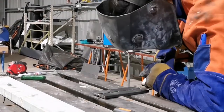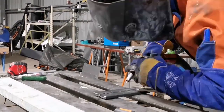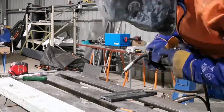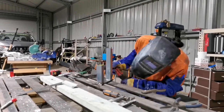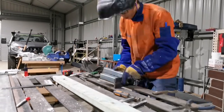To build a hinge of a swing arm tire carrier, this part is particularly important because the hinge actually carries the most amount of weight. For that reason, you will need some serious material in order to fabricate this strong structure. For that reason, I've chosen steel to be my primary material for this hinge.